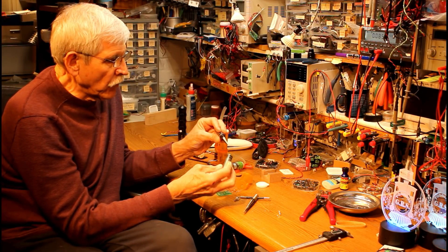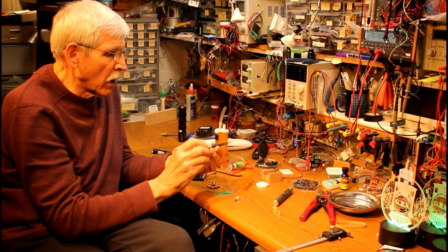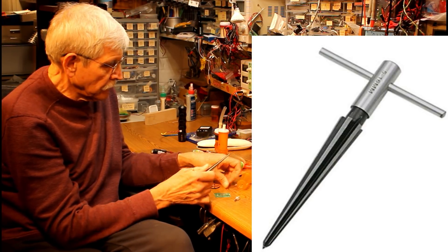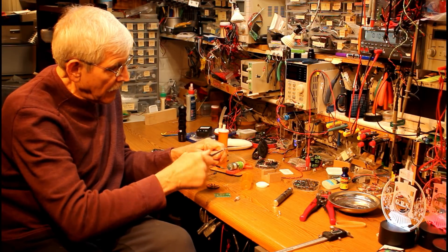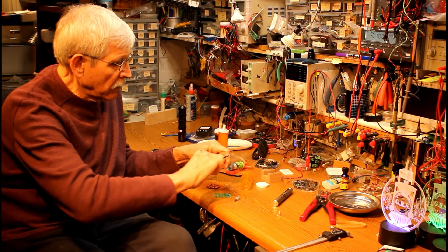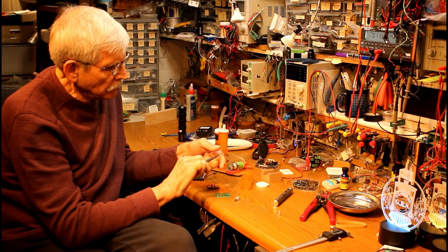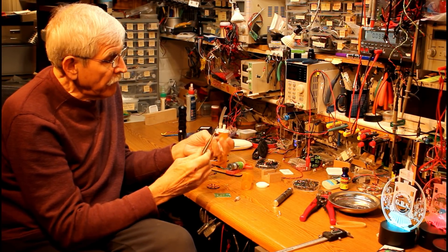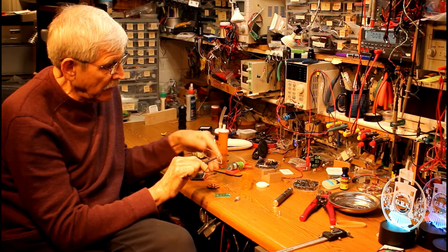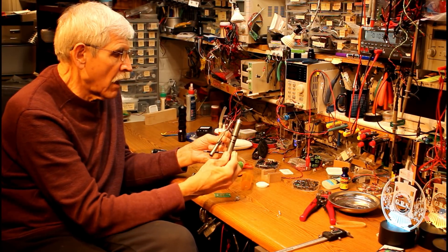This one is for really delicate operations — only taking a little bit. If you want to be a little bit more aggressive, there's another reamer I can use to really dig in on this plexiglass, and it goes much faster. Neither of these is particularly expensive — five to ten dollars, I would think. I'll put a link in the video as to where I got them. But if you ever need to make a hole just a little bit bigger than what your drill bit will do, especially if you need it slightly tapered to take some thin threads, these reamers are really not a bad choice.